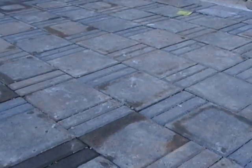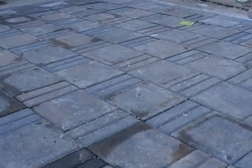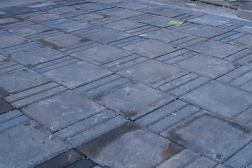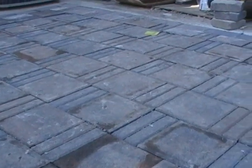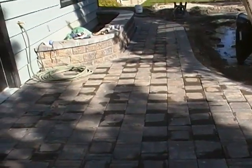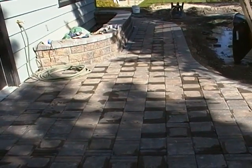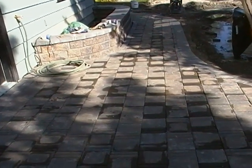Once we plate compact the whole thing, there are a couple phases of finishing off the patio. We have no sand in the gaps right now, so we're going to tamp it once with no sand in the gaps. Then once that is complete, we're going to sweep a layer of screening sand — just normal wash sand, five millimeter wash sand works — as the first layer into the cracks.